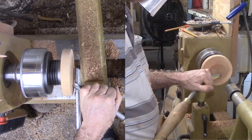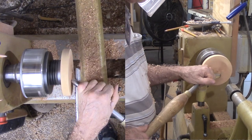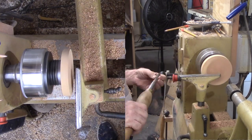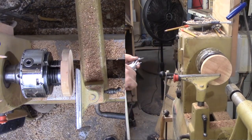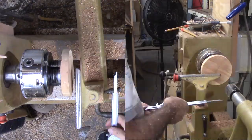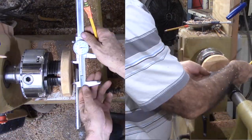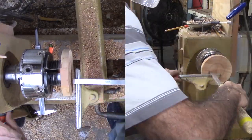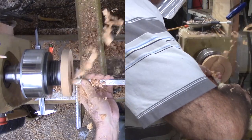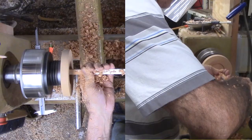With the perimeter established, I can reduce the thickness to something that looks decent. With a good surface established, I am moving on to an expansion mortise. I will shape the inside a bit later, but go ahead and cut the mortise now a little extra deep to allow for other shaping. I can always deepen it a little more later.